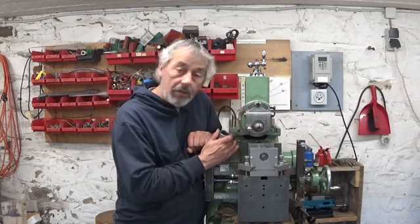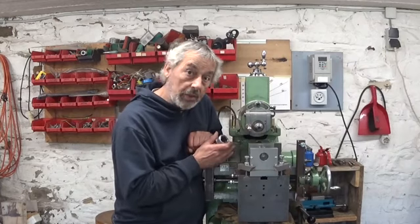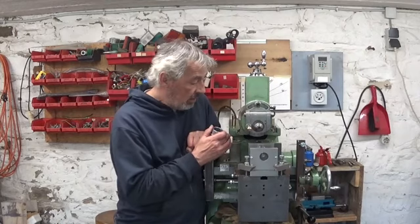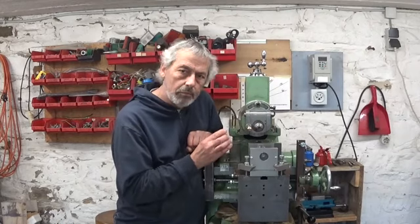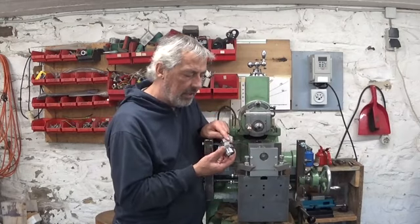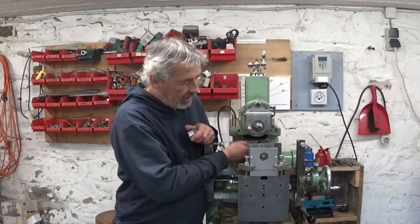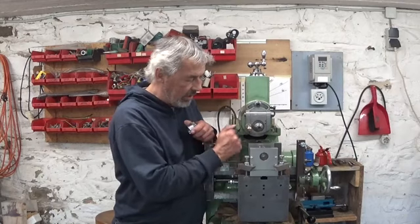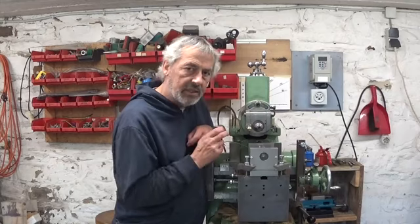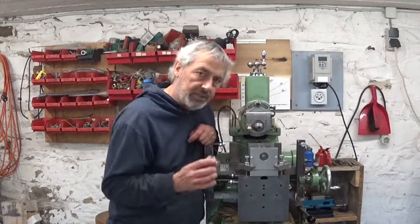I think if you have a shaper and a bit of spare time, give it a go. It's really fun to do. The wire system seems to work. It's just that I have to be a little bit more careful while indexing my gear. I think sometimes I pulled too hard to retighten the system, but for my next gear I think it will be a 101% gear.